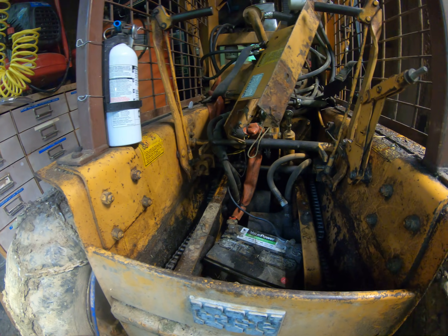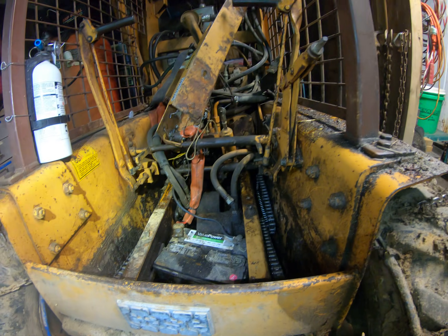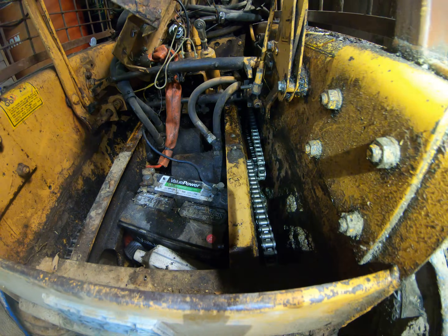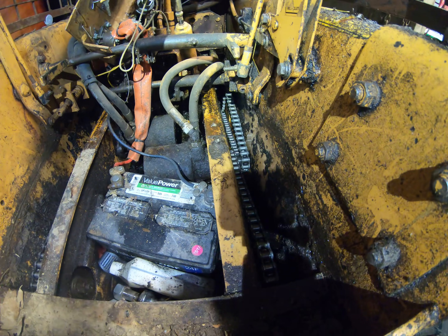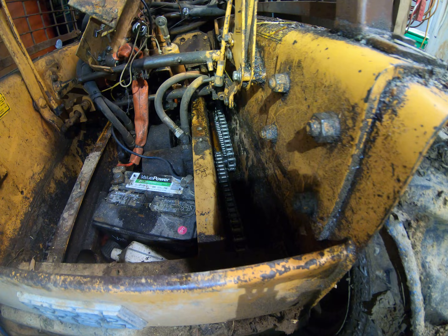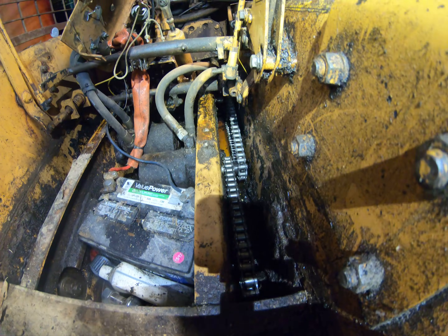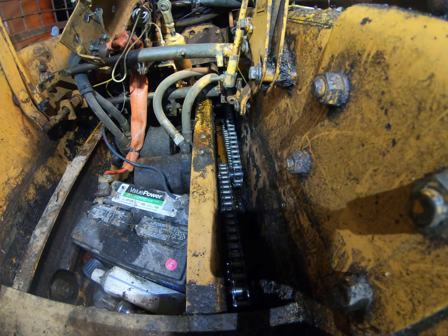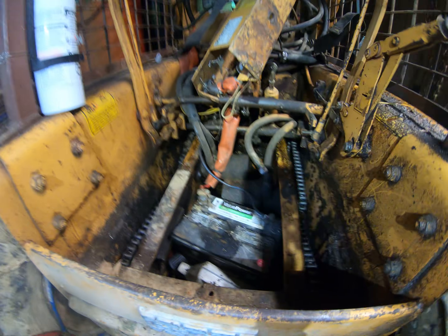I've discovered that today, so I'm going to start it up and show you because it's a tough leak to find — hopefully it helps someone else out in the future. It's actually a leak in this shaft right here, where it comes out of the hydraulic motor that drives the left-hand wheels. I'm going to fire it up and show you that leak, and hopefully it comes out okay on the video. I'm going to set the camera down for a second.